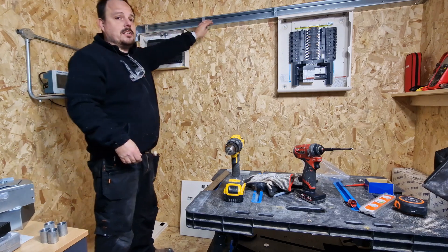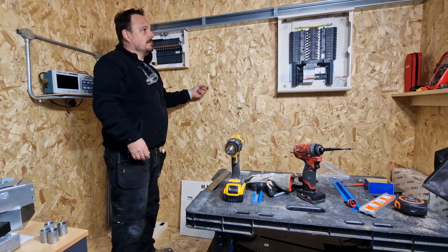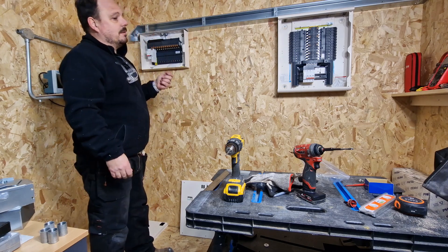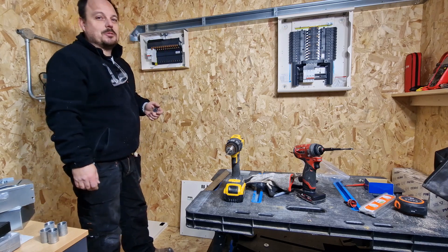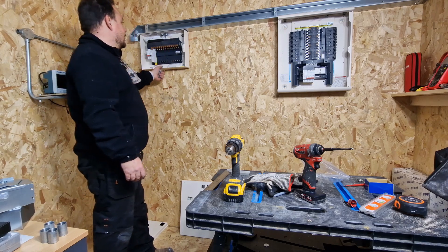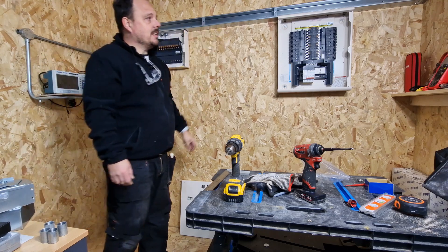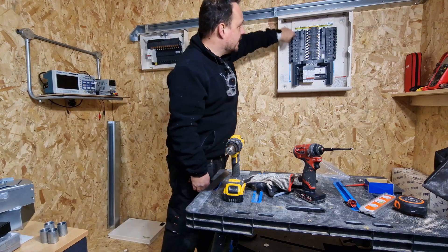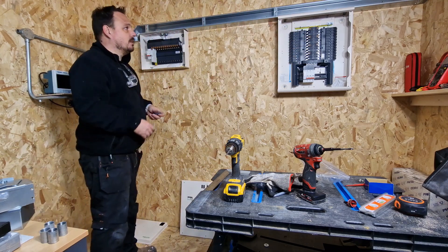You can see I've got the little screws in the back there with some screw caps on. Because this is timber I've used countersunk wood screws, and I've just popped some screw caps on to make it a little bit neater. We've got the single-phase board on, it's got the couplers through, and same in here as well, so we can bring our circuits down. There are going to be more holes put into this trunking — it'll be on and off the wall all the time I'm sure.